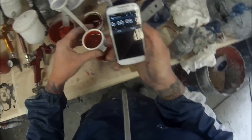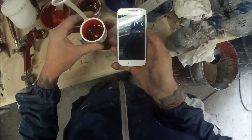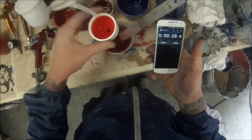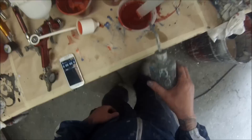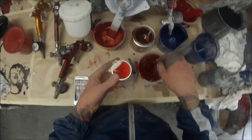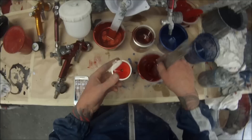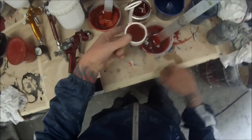At the very end I've made a still image of a paint can and I'll explain the rest of the details it has and what they mean. That one's running quite thick - about 27 to 28 seconds. It can actually help if you've got a mate there to help you, because you can just say 'take your finger off while I start the stopwatch.' But doing it by yourself is okay. Another way is just dunking the entire cup inside your paint, then pull it out - the second you pull it out you start your timer. That makes a bit more of a mess on the outside of the cup though.